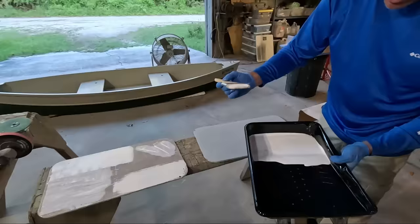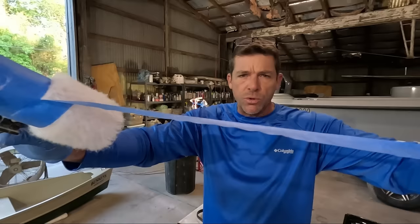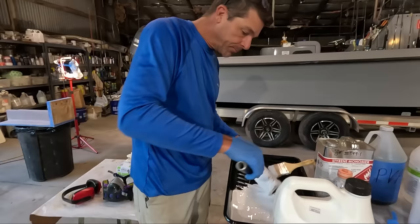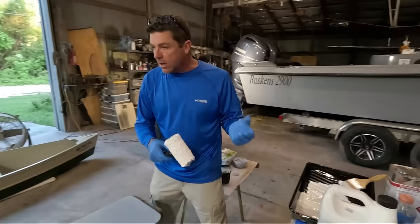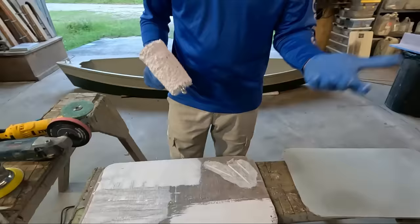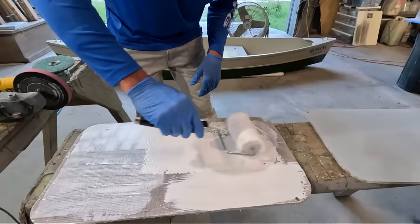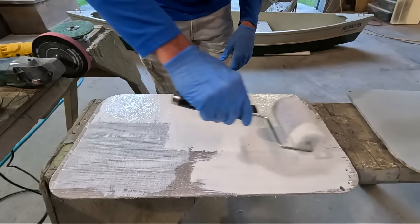There are several ways you can apply it. You could go with a high-quality brush; honestly, a lot of times we use fairly inexpensive chip brushes if it's a commercial gray job and we're just trying to get material on there. It's going to take two or three coats sometimes to get full coverage, and a brush is going to leave some brush marks. I tend to like a roller for a lot of our applications. I'll take a little bit of blue tape to remove some of the hairs off the roller — that gives you a little better quality on the application. Load the roller up so it has a good amount of gel coat on it, but you don't want to overload it where it's dripping and running off.